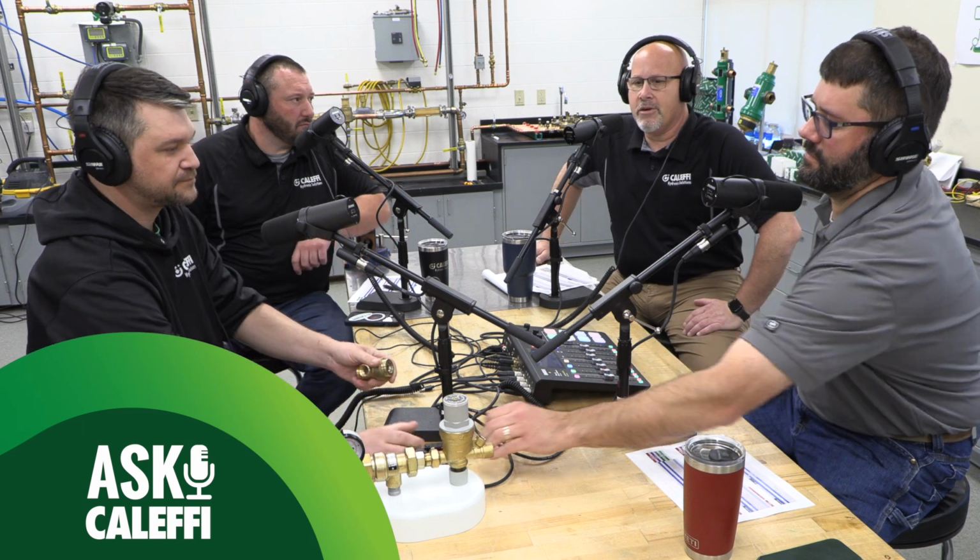So you save the customer a few bucks. You charge them a service call, but you can make it work again. It's pretty easy to pull apart and clean. Yeah, you could clean it and save a return trip if you don't have a replacement on your truck. Yep, definitely. So it comes back to the serviceability of our products. That, and the autofill. Our autofill has a screen inside that'll protect the cartridge. It's easy enough to pull the cover, pull the cartridge, clean it out, and put it back in service.